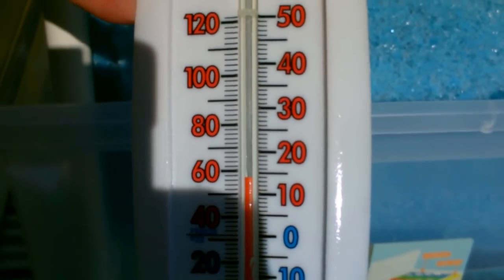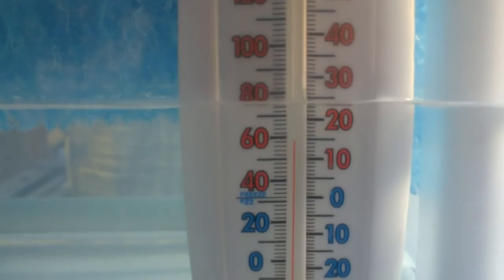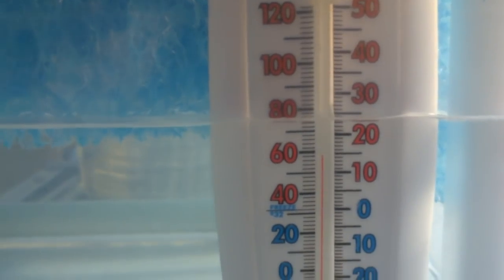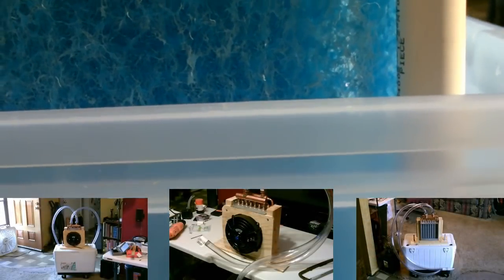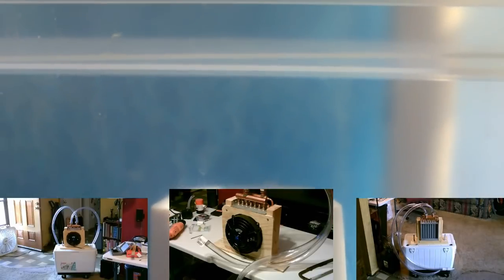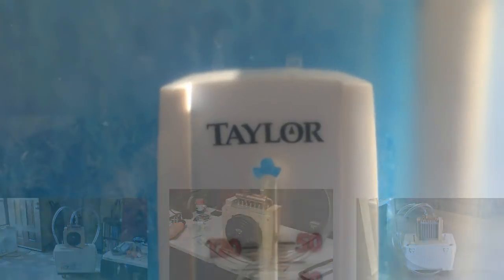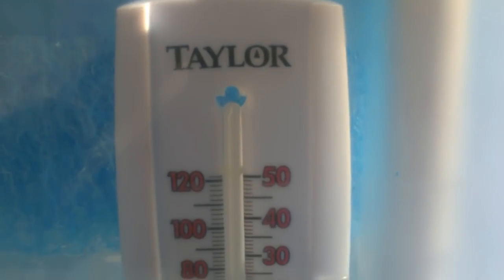So 63, 64-degree air, and water temp around 57 now. You can't beat that — it's also a good way to chill water if you need cold water for some reason. By the way, that's how they do two-stage evap cooling. You use a unit like this totally outside, it produces chilled water, then you pump that chilled water through a heat exchanger — like in my last AC cold water air cooler video — instead of using ice or cold tap water. Then you drop the vinyl pipes in and push it through the heat exchanger, pump that into your house, and leave the cold moist air outside. Using evap cooling you can get just dry air in your house.